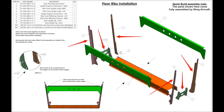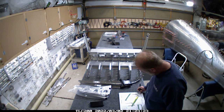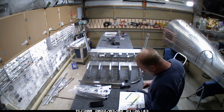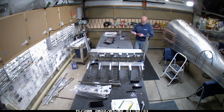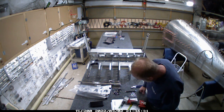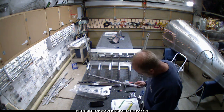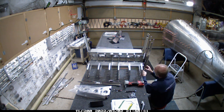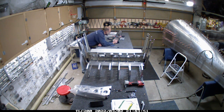The next step — those red arrows show the vertical pieces where the skin on the side of the plane is going to attach to. They get attached to the landing gear channel that runs just behind where the spar is. And you see me fitting those black pieces into place because those are parts to hold on to the main landing gear itself, and then the parts that are standing up are going to be attached to where the skin is.